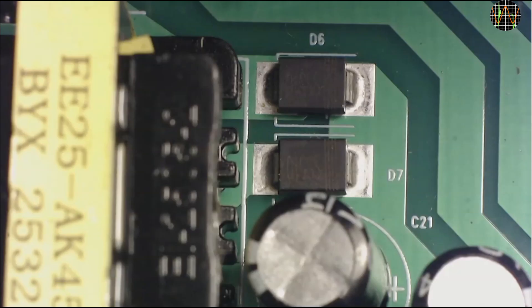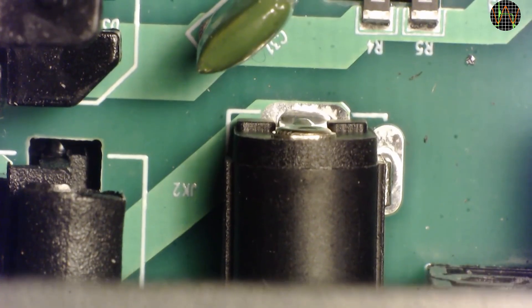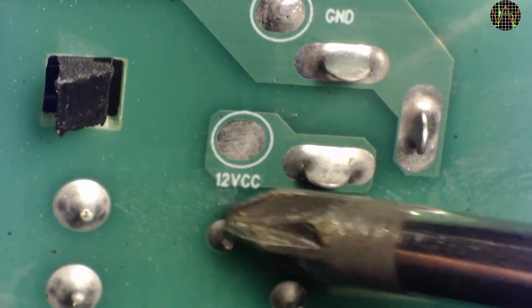This is a neat solution. It provides polarity protection if your DC input has reversed voltage, and if both AC mains and DC are connected, it would automatically switch to whichever source provides the higher voltage. But be careful with the voltage on the DC socket since the caps in the amp are only rated for 16V. Not so great is the separation between the trace of the DC input jack and the next trace, which forms part of the high voltage side of the power supply — it is about 3mm, or a bit more than 1 tenth of an inch. This gap is probably enough but more wouldn't hurt, especially because they did a lot of things right, like the cutout under the 100K resistors. On the underside the situation is similar.